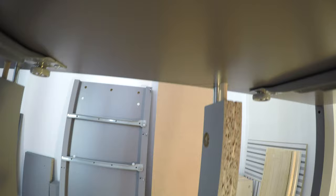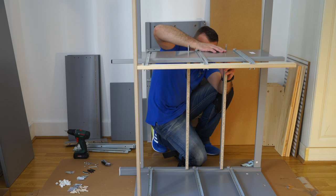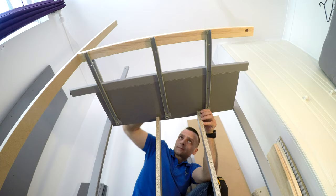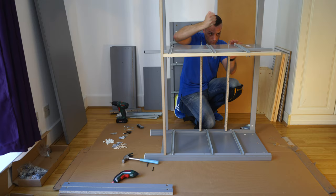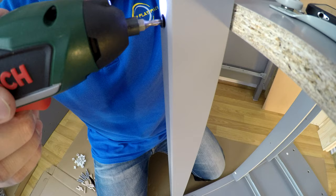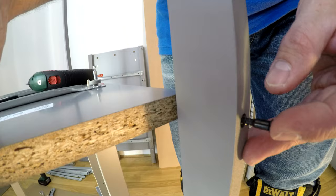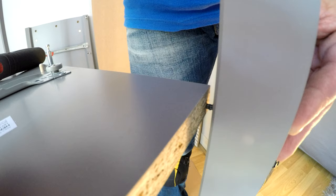At this point it's kind of holding, so you can focus on the front. You'll see the hole where it goes from the top into this panel, connecting the whole thing together. Press it all in slowly and tap it in — go easy because the whole construction is a bit flimsy at this point. You can see those wooden plugs coming through to the other side. Secure the long screw through the bottom and exactly the same through the top. Everything is pre-drilled so you don't need to worry about drilling any holes — just find the right hole and secure the middle panel from the top as well.